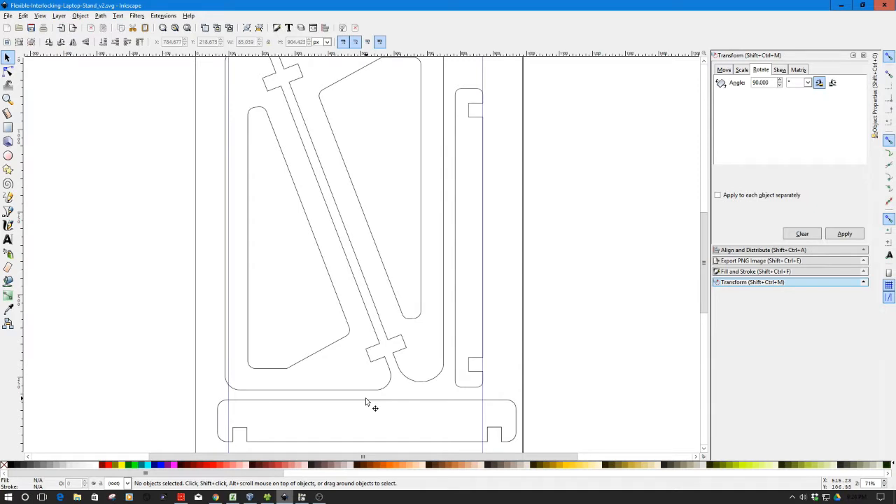This larger piece will slide into here. One of the things I typically make these notches a little bit loose rather than snug, because it's very difficult to keep shimming these out once you cut them. There's that old adage - you can't add but you can still take away. I also talk about that when we get over to Cut2D and some of the tool pathing strategies I used.